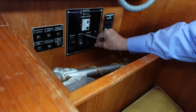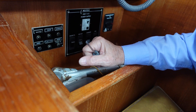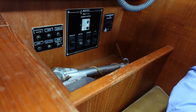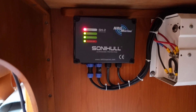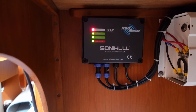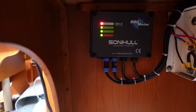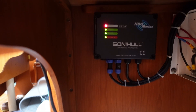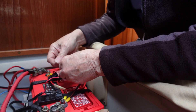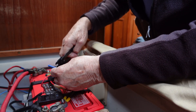And we're done. So AUX now is the ultrasonic antifoul system. The ultrasonic unit is connected up and working now - that's on mains - and I'm just about to sort out the DC side of it so that when the mains goes off, the battery takes over. I'm fitting an in-line fuse holder with a 5-amp fuse to feed the ultrasonic unit.